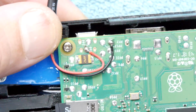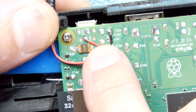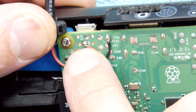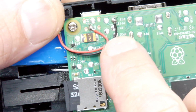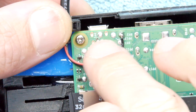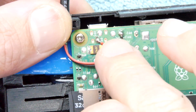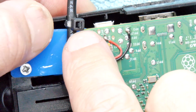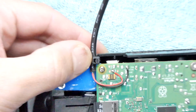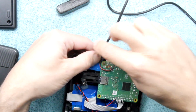And while I was at it, I noticed that there's two handy test points here: PP2, I think that one was, the 2's a little bit obscured, and PP3. And to those I attached power wires, because this USB port doesn't seem to be On-The-Go, there's no data capability, it's purely power. And I attached a piece of wire, and you can see some strain relief. And on the end of that wire is a USB plug for getting power.